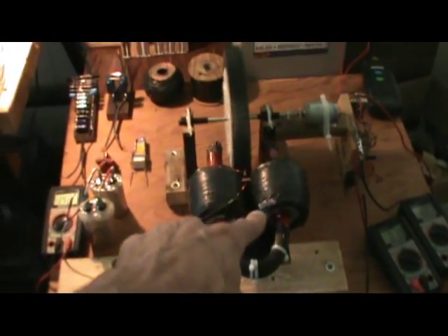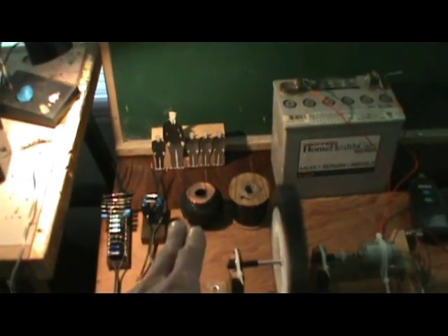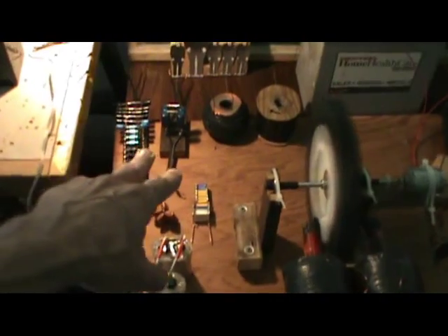What I've done here is — these are my 28-gauge-ish, my thinnest wire coils I have for this setup. I have a laminated U-core. I've tried 22 gauge, I've tried 18 gauge, and cap banks that I made for the different inductances to find resonance with the wheel. For this demonstration I'm going to show a couple of microwave oven capacitors.